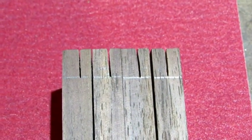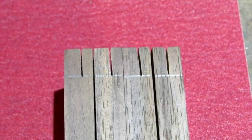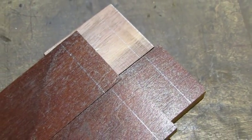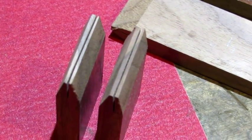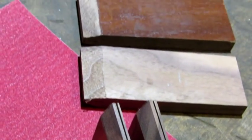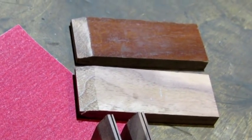The next thing you want to do is use a coping saw to cut some half inch notches in the end of your scrapers. After that we're going to bevel the ends where the blades go in. I've marked both sides at a half inch so I know where I want the bevel to stop. I could use a belt sander to do the bevel but that would be cheap — we're making this for working on planes, so what better way. The bevel is not an exact science, you just got to nick it off a little bit. It allows on the short ones a place to grip it better, and also lets you get down into tight places without excess wood sticking out down near the box knife.